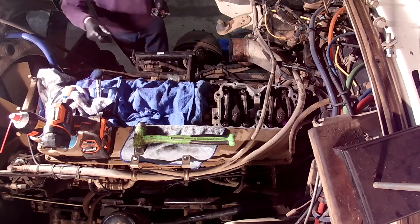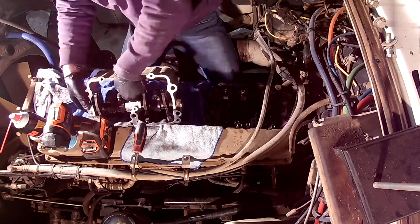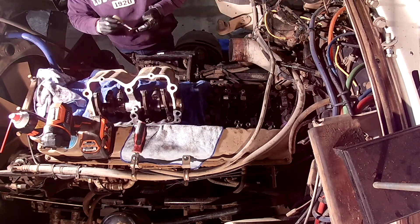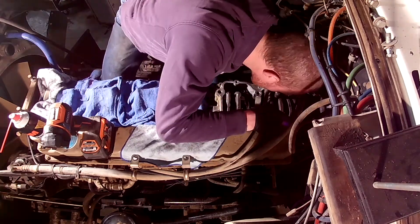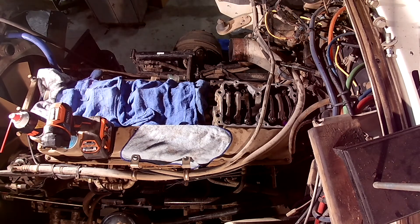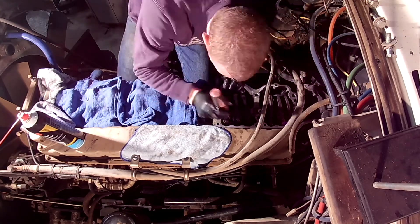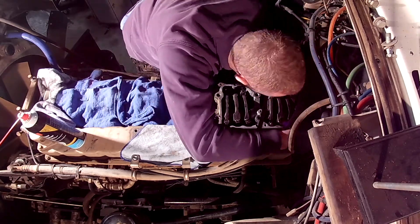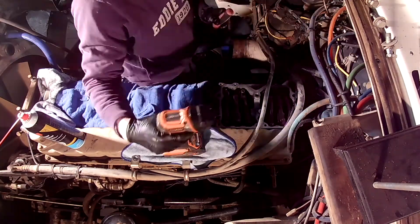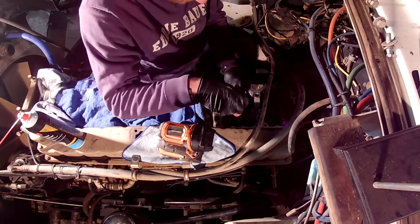Once a Cummins big cam motor reaches around 1800 RPM, a single entry turbo performs well and exhaust reversion becomes a problem no longer. These RPMs are approximate. Single entry turbos need high RPM or a lot of pulses to start creating boost, but dual entry turbos don't need the high RPMs and are able to build boost at lower RPMs with fewer pulses from the motor.